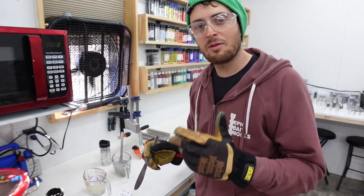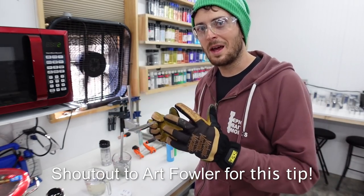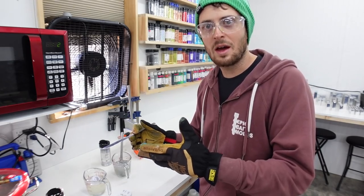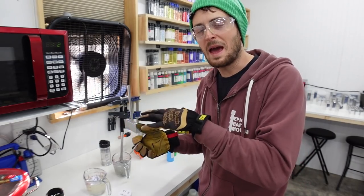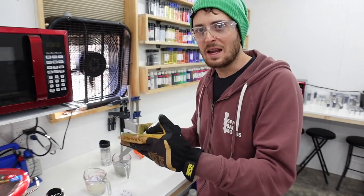I'm starting with the flake because a good friend of ours said he's been starting with the flakes to build the texture. Like if you mix plastic, put your pigment in, then add your flake and it's darker than you thought - well, if you start with the flake, you can remedy that situation because you're adding your pigment later. So you add less pigment and you can actually match the right translucency of the plastic.